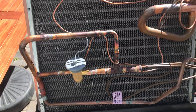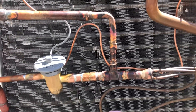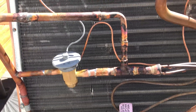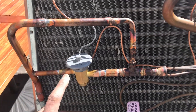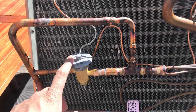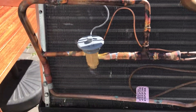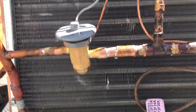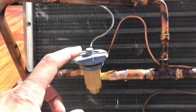What I really wanted to show you is the difference between brazing and soft solder on the outside. We were not very good at brazing — we burned up one of these valves and had to replace it with a brand new one. The first time we used MAP gas with Silphos 15% brazing rod and it just cooked the valve.